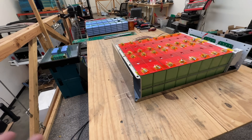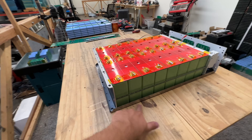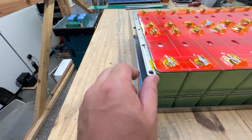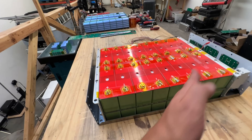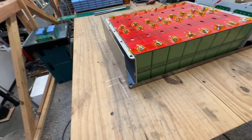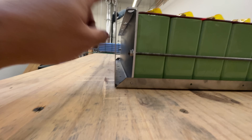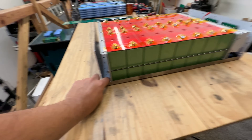Yes, I would eliminate one part and save a little bit of cost, but it would introduce more issues. This enclosure is an L-shape — I'm making the bottom and back side as one bent piece to minimize parts — but that wall is really thin. It's thick enough to be a sturdy enclosure but not thick enough to compress the cells. It was deflecting a lot, so to fix that I would have to add an internal stiffening plate, which means I'm not actually saving anything.